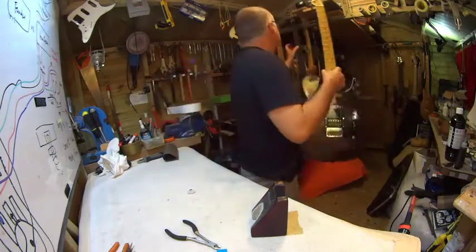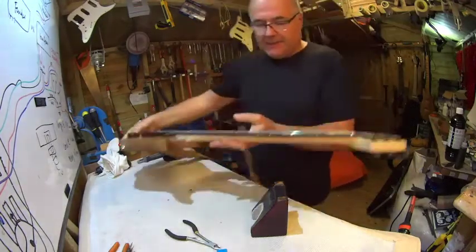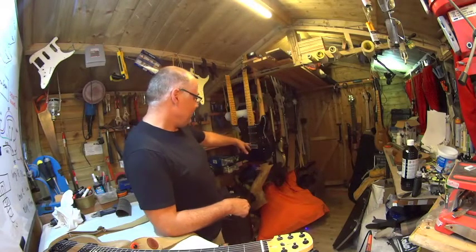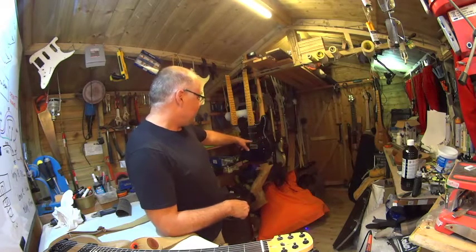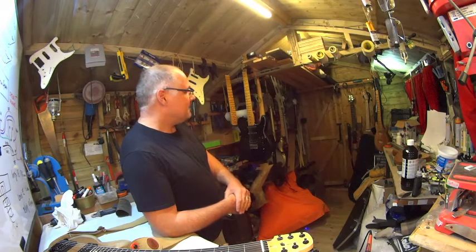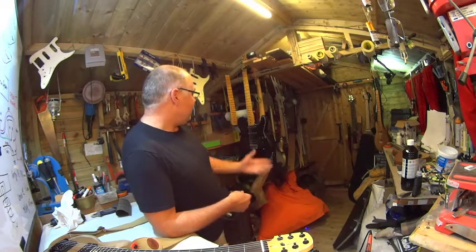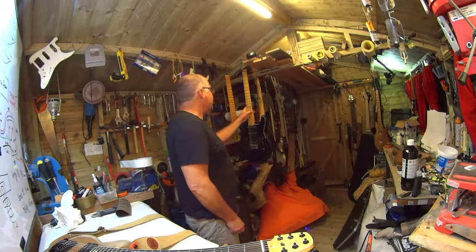Beautiful, I'm done. I'm going to switch it over for this one. I've got to do something else. So that's Murray's Modern Player Telecaster, done with change of pickups, installation of a different three-way switch, giving him humbucker in series, humbucker in parallel, and split coil, single coil there. And I can't remember which one doesn't sound massively impressive. I think it's the parallel one, but it gives you a nice high powered humbucker, which is what you want.